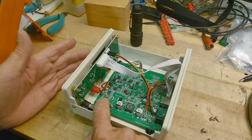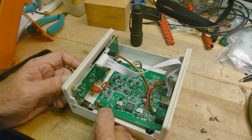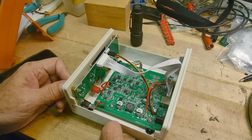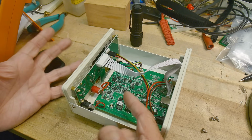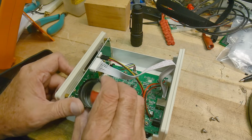So you bring in 5 volts, it generates minus 5 volts. So you have plus and minus voltages. So these op amps probably need plus and minus voltages, and that's where they're getting the minus voltage. That's what I would guess. And then this thing here probably is a switcher, so you've got 26 coming in. You don't want to just linearly drop that down to 12 volts or whatever it's required inside here. And so, yeah, that's what you got going on there.